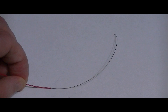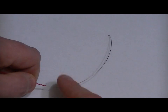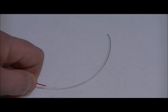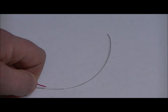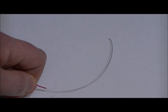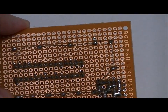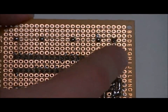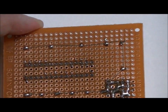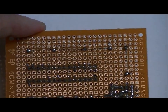Here's a trick: you can create easy traces with a stripped piece of wire. I've stripped the insulation from the end and I'm going to create a common ground line and a common 5-volt line on the bottom of the board. This makes things easier so you don't have to run wires all the way from the power supply circuit to the chip. I've taken that wire, cut it in half, strung a ground line along the bottom, and a 5-volt line along the top, held in place with solder dots — just to mimic a breadboard.